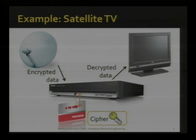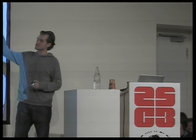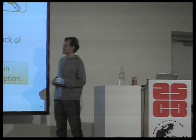So all these hardware security applications rely on either a cryptographic cipher or a cryptographic key to be secret. So there must be something that only your customers know, that only your employees know, or their respective cards know. And in hardware security, the mistake is often made that both of these are kept secret and that the security is spread across the two. In cryptography, we very much rely on the cryptographic key being secret, where the cryptographic cipher should be some published standard, and it ought not to be secret because people like us reverse it from hardware. So that's what we're going to talk about today, breaking cryptographic ciphers by simply finding them. And since any cipher that isn't standardized is usually weak, we then normally break it within a few days.